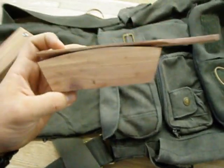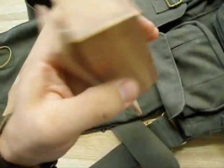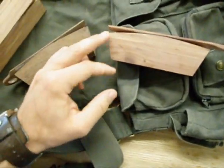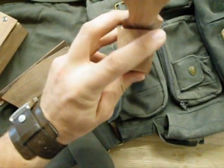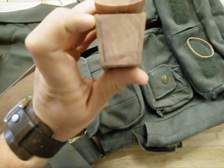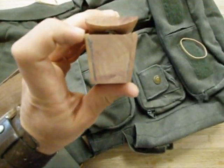Here's the call I just finished - it's for my little brother. I call it the Swamp Walker Sweet Talker. This right here is about one and a half inches. I really took the same dimensions from this call - you can see I made the very same side. So this is still one and a half inches, and this will be one and three quarters. The width I made substantially narrower. The top of the box where I've got the width is one and a quarter, and then these are each an eighth inch, so that should end up being an inch and a half by the time you get it all together.